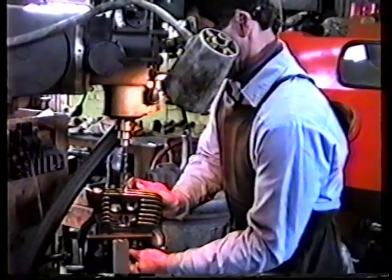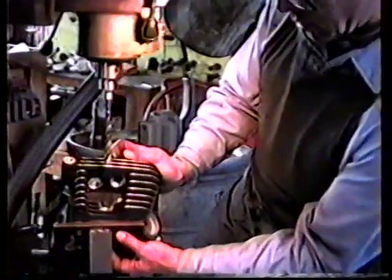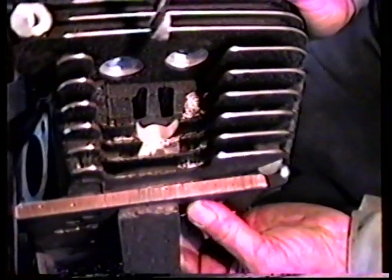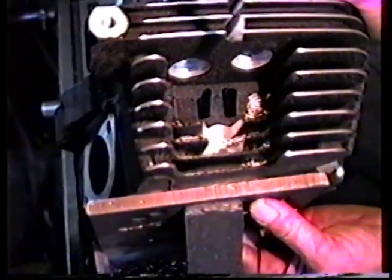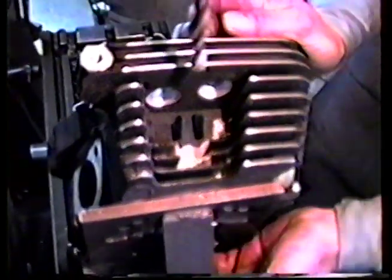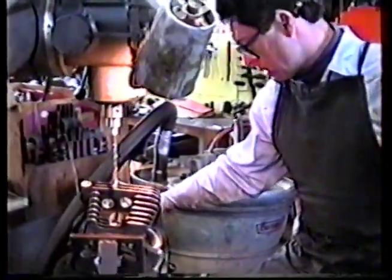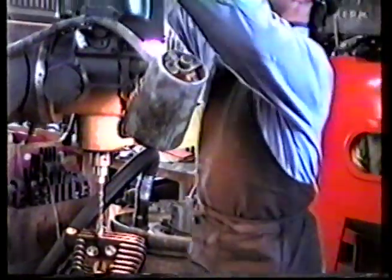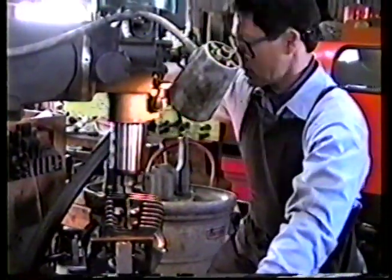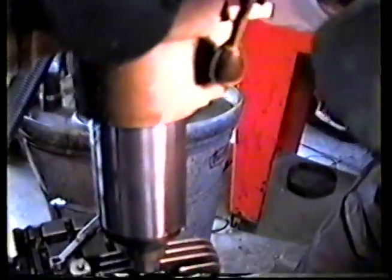Let's check our depth and see what we've got. Would you look at that — another good guess. This is our little depth gauge. We slip it in the hole from the bottom and it's right dead nuts on the money. So we don't have to machine down on this one anymore. We've got one more step to go — we drill this thing for the insert size. We're drilling our holes for the final size; we only have to take out just a few thousandths on this pass.